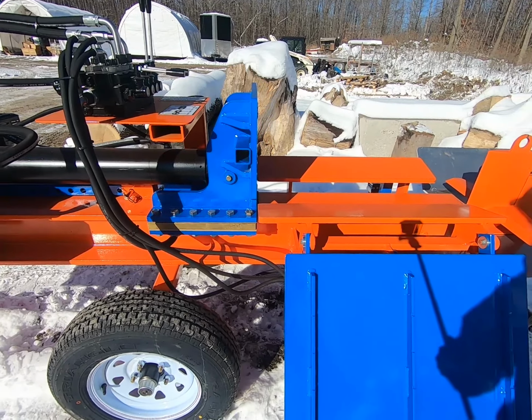And this machine has a 4.5 inch cylinder on instead of our standard 4 inch cylinder. So you end up with it around 30 tons, 32 tons with it. So it has a little bit more power than our standard 1222 just because of the length of the stroke we do that. It still performs really well. It has a 10-second cycle, which is a little bit slower than the 24-inch model, but naturally you would expect that. But as you can see, when you do short cycle it, you can really make some time on it. Works really well. This option here right now, it's around $1,200 US, $1,500 kind of, depending on exactly what options you want on it.